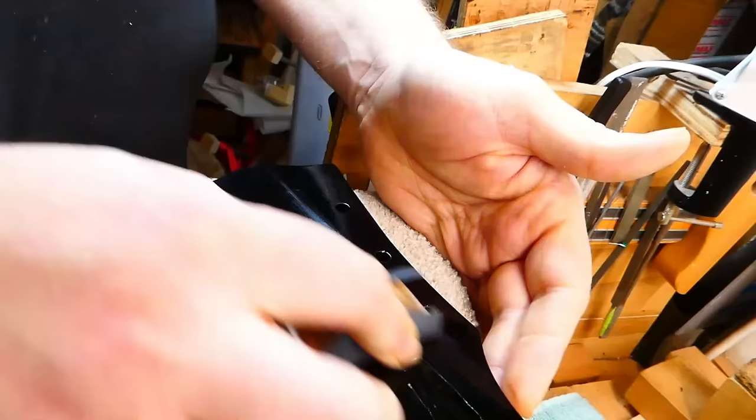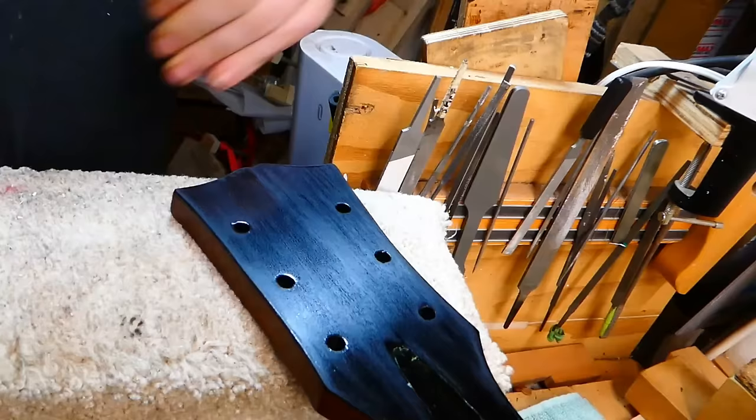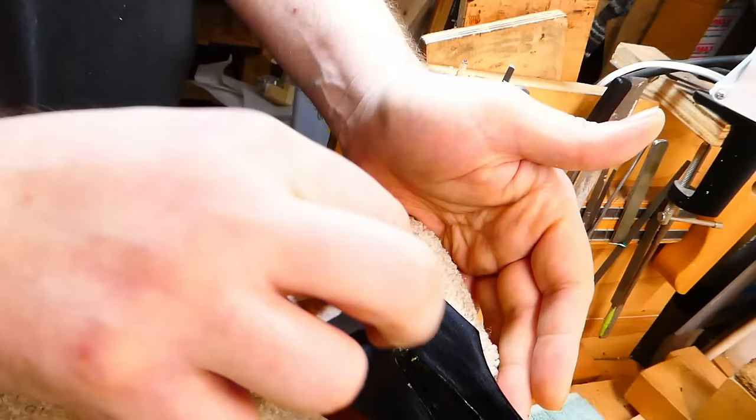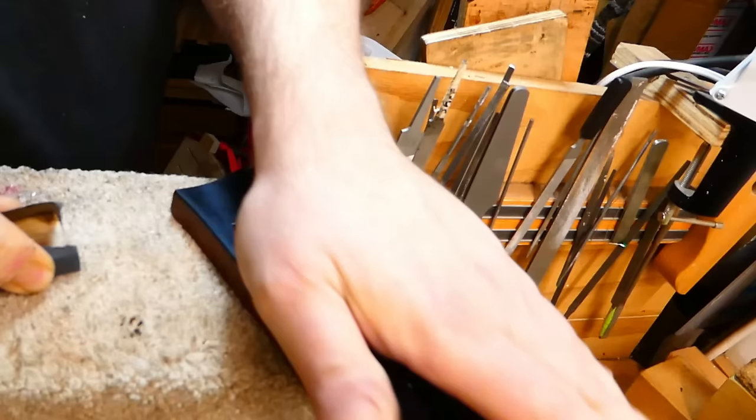I want a good smooth flat surface. 600 grit might be a little too coarse, and the scratches can sometimes show up in subsequent coats of lacquer. So I'm using 1200 grit, which takes a bit more elbow grease, but better safe than sorry. Frequently dusting off my paper — I do this dry. I started doing it dry some time ago and I like it better.